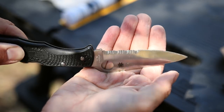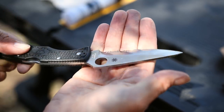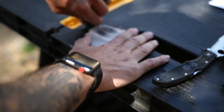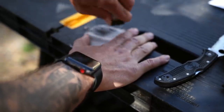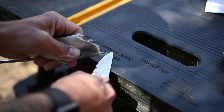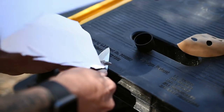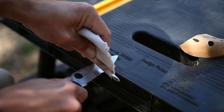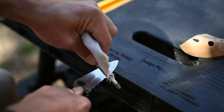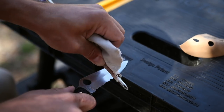So now we are almost perfectly shiny on our edge after that 600 grit sandpaper. The last step is just going to be using some polishing compound. This stuff is basically just like a crayon — you color onto a piece of cloth, this is denim, I'm just going to saturate this, then wrap it around our tool. This is sort of a one-way street, essentially like the leather strop we do for sharpening a plain edge. This is not my favorite method for stropping — I actually typically use my Dremel with the polishing compound, but I just wanted to show you that you can do this without a Dremel.